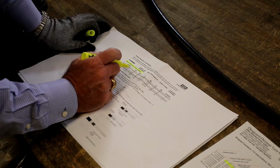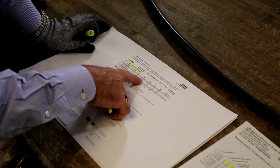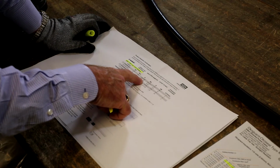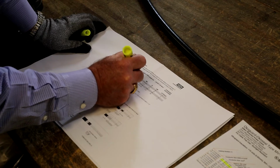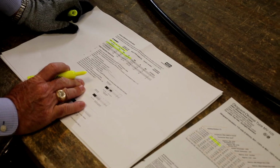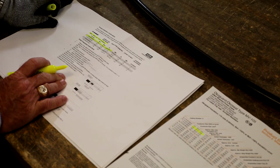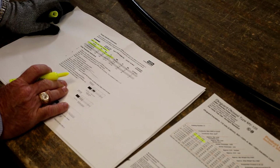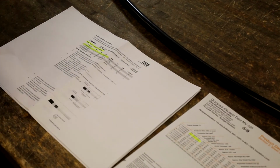Using your Burndy installation guide, it is recommended to take the time reading through and highlighting pertinent information for your specific installation to ensure proper cutback lengths for each layer. Determine the proper lengths of cutoffs for each layer of the conductor to ensure a proper install, and for your mastic that is inside the tube to sit correctly at those critical locations. Please make sure you carefully go through step by step with your installation guide.